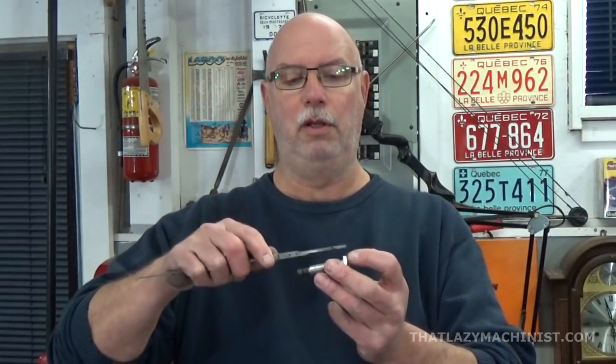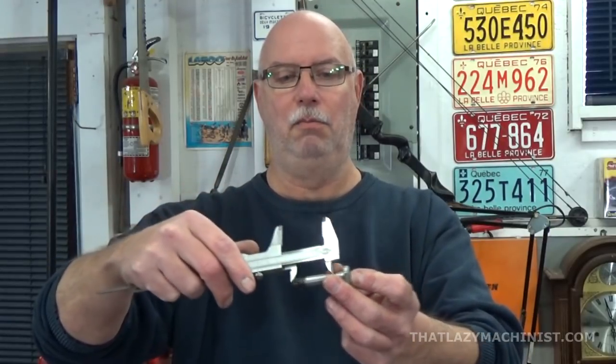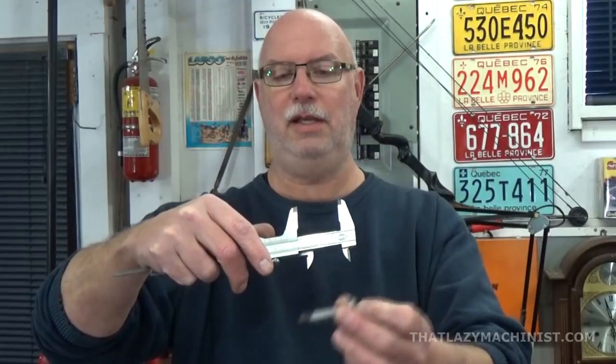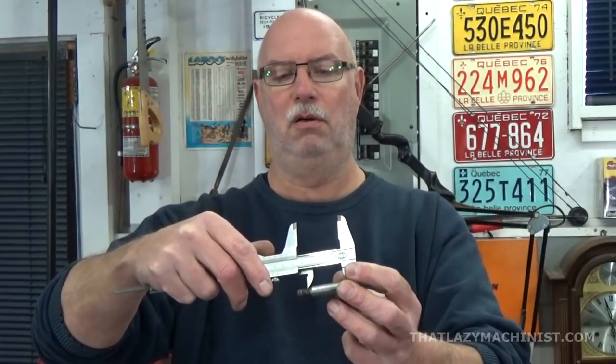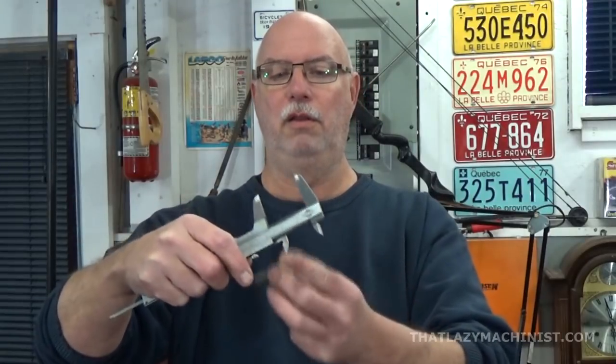And all I'm going to do here is position this so that I leaned up on the bottom of the hex, where the diameter that I need to bush starts, and I can set it about 0.02 of an inch longer than what I need. I'm going to want that clearance for sawing the bushing off of the main bar once I've turned it. So that's my basic length.